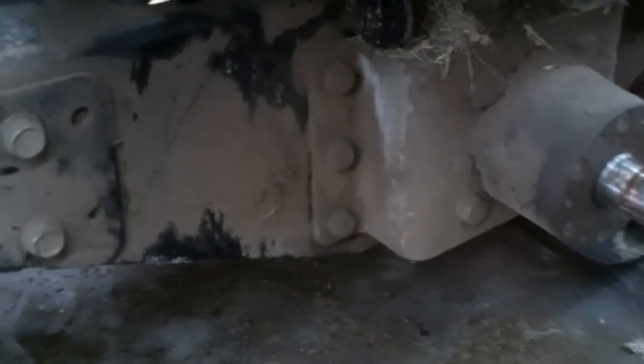The reason I'm going to replace these hydraulic motors and pumps is because the customer wants it, plus there's no telling what kind of damage was done by running that hydraulic oil in here. The next step is to clean everything off real good with compressed air. Wear your safety goggles when you do this because it will blow into your eyes. Then we'll start unbuckling hoses and getting these pumps and wheel motors out of here.